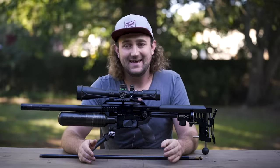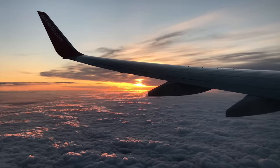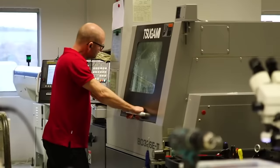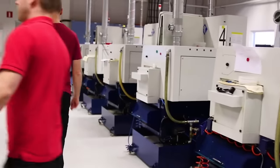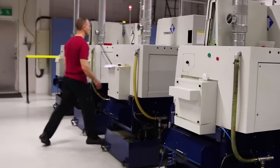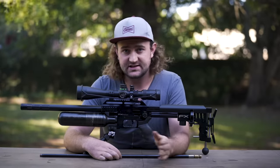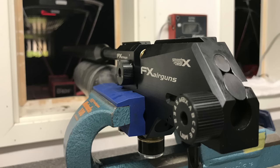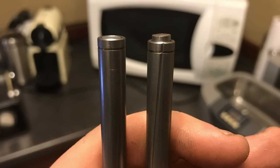I did a lot of research, and I took all this research with me to the FX factory with long lists of tests that I wanted to do on these barrels and on these projectiles. And the beauty of it was that, thanks to FX's barrel machine, I was able to actually make minor changes to, let's say for example, I wanted to test land groove dimensions. I could adjust the lands and grooves on that barrel. I could test it and I could see whether it was improving or getting worse, and I could find where the optimum land groove dimension was. I could then test the lead. I could see how long the chamber must be. I could test whether the slug must be jammed into the lands or have some kind of a jump. I could test the choke. I could test everything, and I could move through it really quickly, and we could find solutions very quickly.